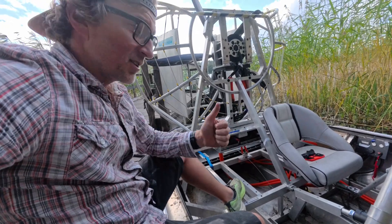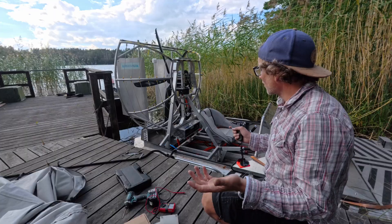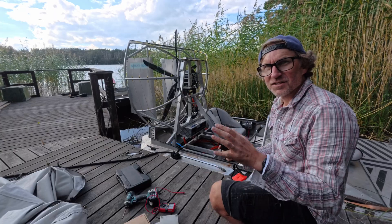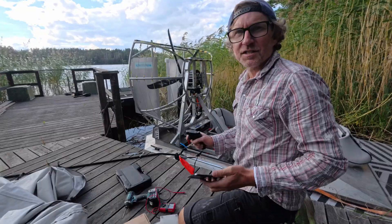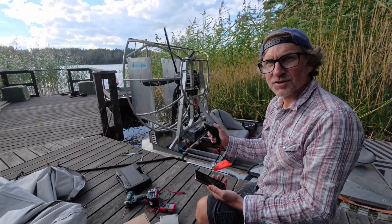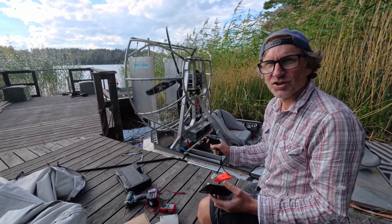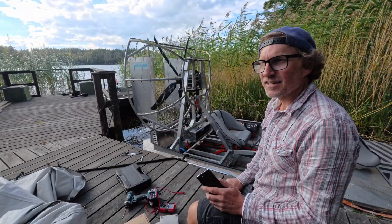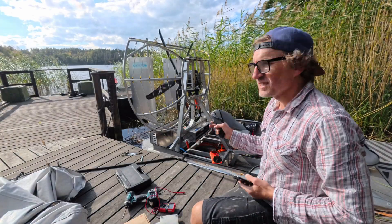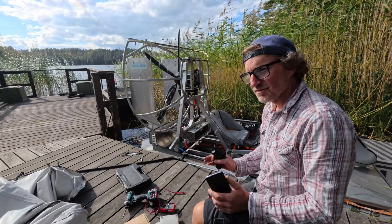It's mounted into the boat now, so fingers crossed it starts up — let's give this a go. Good, nothing's touching the prop. First go. It starts a little bit, slightly rough there. What I'm going to be looking for is that the two systems are actually powering each of the halves, transitioning to reverse. As you can see, that's pretty rough — it's having a hard time deciding where it is. We're actually running sensorless, which does add an element of durability and it's just one less thing to go wrong, but in the programming stage it does mean there are quite a few variables that are going to be difficult to get around. You've got to program carefully and feel your way forward with that.